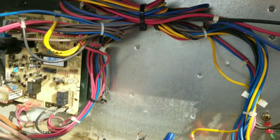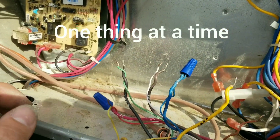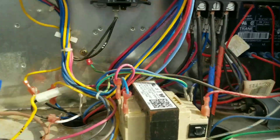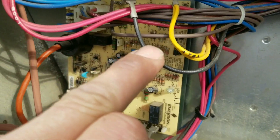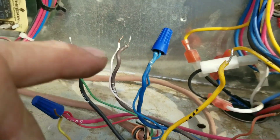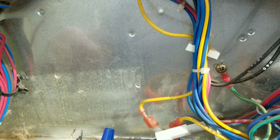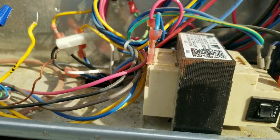This is not a perfect science — I'm just going through it step by step trying to figure out what's going on. G is disconnected. Everything looks normal now, I've got 24 volts. Yellow and green are pulled off the board — this is high voltage — and I don't have a W call. I left the W on there. So there's my G call. Everything still looks normal.